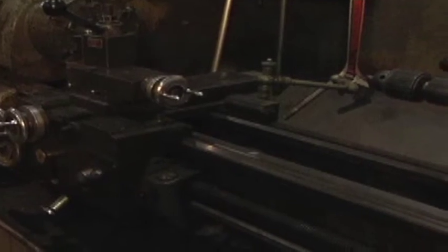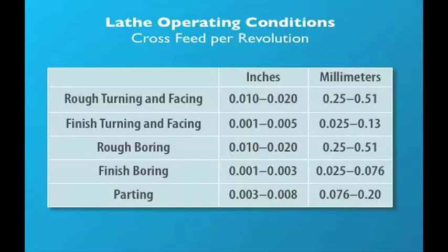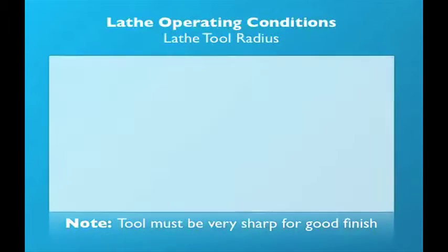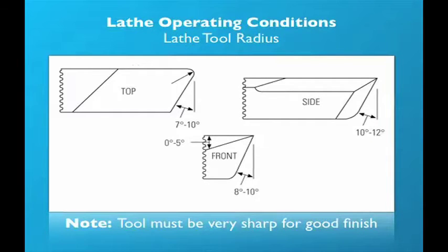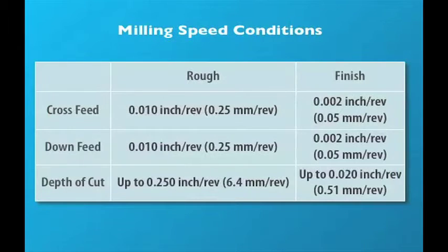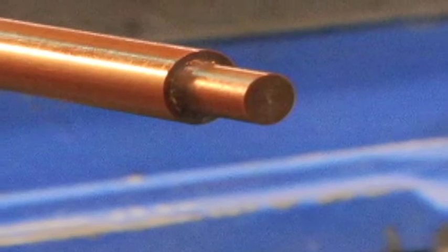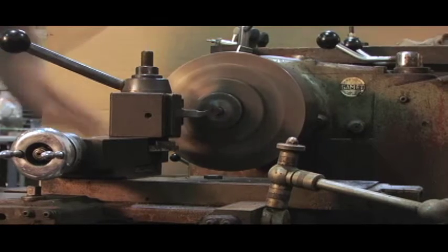Use carbide-tipped or diamond-tipped tools for work that requires close tolerances, and consider using chip breaker tools. Before starting, hone cutting edges until they are sharp and have a nose radius of .003 to .008 inches. For cutting speed, consider a range similar to that used for machining brass. If heat begins to build up, a coolant should be used to minimize thermal effects and to maintain dimensional stability. If chatter occurs, double check tool sharpness and check to see if the tool is extended too far from the holder.